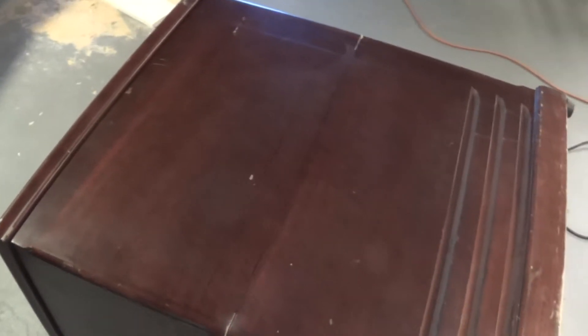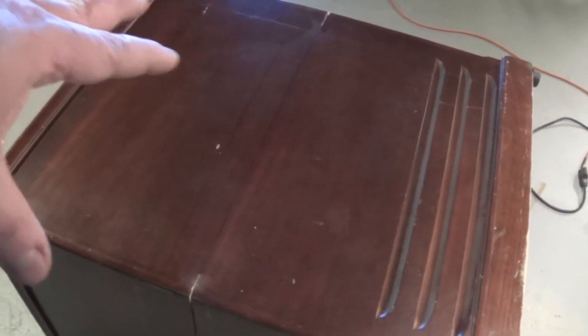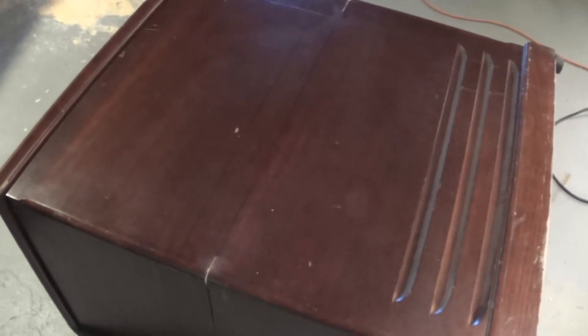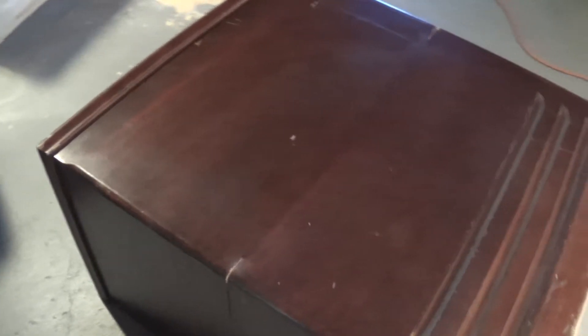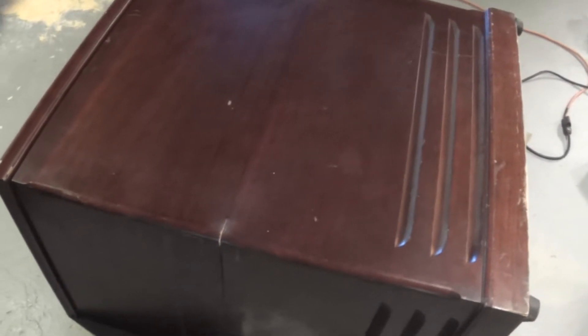By running a circular saw up each side, I can see on the top the two lines I had to join together. If there's a little chipping or whatever, that will be hidden by the molding, because after I take the top section off, I'm going to remove the top, put it on lower, and then replace the molding. I've managed to keep the molding on the top by disassembling it, keeping the molding connected, and just putting it on like a hat.